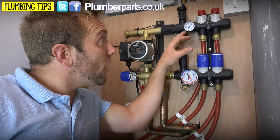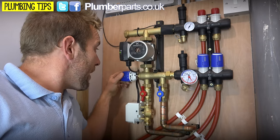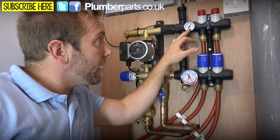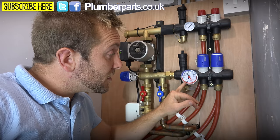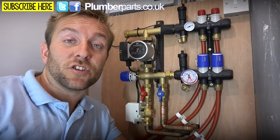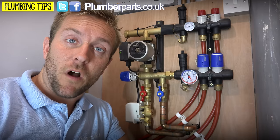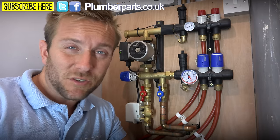We've got a flow temperature going around at about 45 degrees. If I want to get that any hotter, I can just whack that open like that. And we'll see that this dial here should start to go up again. So look, that's going up to 50 now, it's creeping up. The temperature on the returns is slowly starting to come up as well. That's sitting at about 30 degrees. And you should really have about a 10 to 12 degree differential between the flow and return. And then, you know, you're getting the water to go through at the right rate. There's no point burning hot water through all the time because that makes the system sort of inefficient.